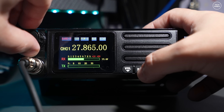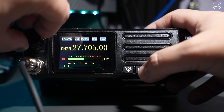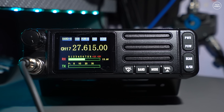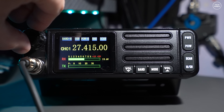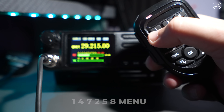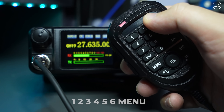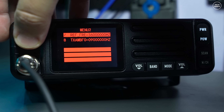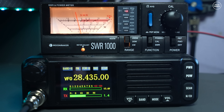You can change modes on these channels and they'll be saved for future use. The scan button works in channelized mode but only on FM if the squelch is closed — scan stops when the squelch opens. By default all channel memories are set to sideband, so you'll need to go through each channel and change it to FM to use the scan function. To return to expanded mode simply enter 1-4-7-2-5-8 and press menu again. There's also a secret menu accessed by typing 1-2-3-4-5-6 then pressing menu, where you can change frequency offset — but I'd recommend leaving it alone unless the radio is off-frequency.